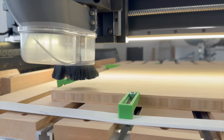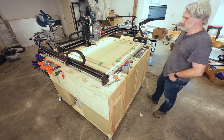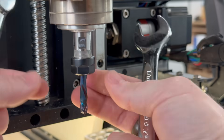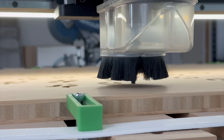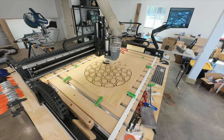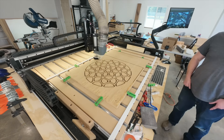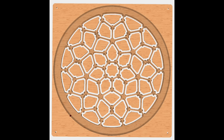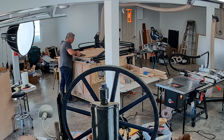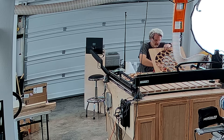So what you've been watching me do here is set up my CNC machine for machining out the first of three layers of bamboo plywood. The first cuts I am making are for the steel dowels that will be used for alignment later on, like when drilling the screw holes in the back and for the layer glue up. This layer will be the front of the light sculpture. This machine is a Shapeoko 5 Pro. I had plenty of experience with building my own 3D printers, but with 3D printers, the concept of work holding is just whether the first layer sticks. As a result, I underestimated how tricky work holding could be. Notice all those pieces inside each cell? If I were to cut them out like this, they would jump out and cause the CNC to crash the moment you cut the first one. So instead, they are held in place with tabs, and these tabs must be removed manually. This is just the first of many tedious and repetitive steps in making this light sculpture.